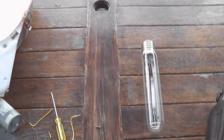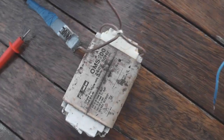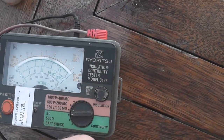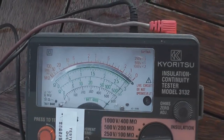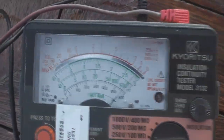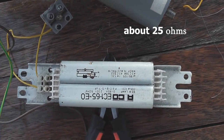It's 2nd January. Just digging around with some more sodium lamps — this one I just fixed. That was the old ballast in there, a 100 watt ballast. I worked out, turning the ohmmeter on, these ballasts shoot out about 2.9 ohms, and that results in blowing fuses. That ballast is discolored. So I used a fluorescent tube ballast, and it seems to work fine.